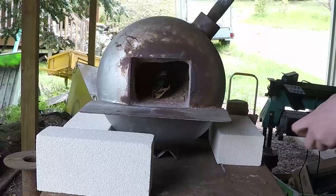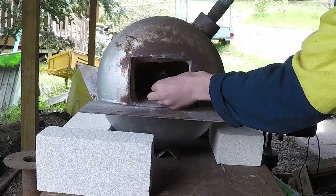Unfortunately I lost the footage of me drilling the holes. Next I light my forge and heat the knife up to when a magnet does not stick to it, and then dunked it in the oil.